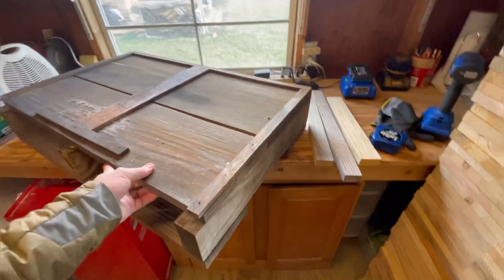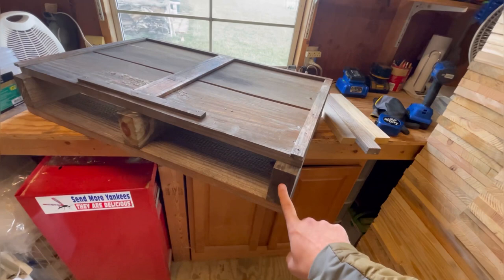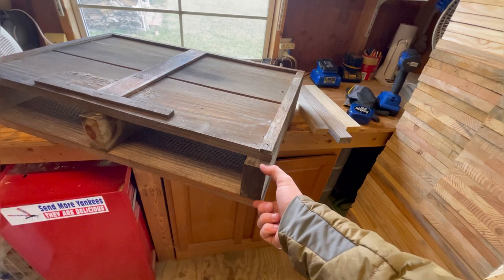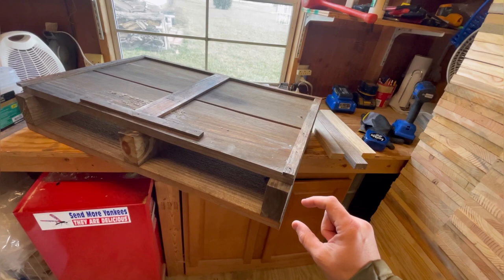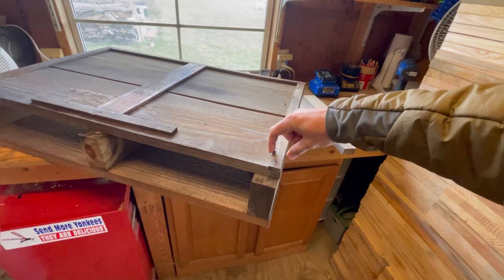Turning it around on its side, this is a true two-inch by four-inch. The two-by-fours are special milled for me. This year we're going to 1.5 by four inches. It's important to keep everything four inches so that when we stack them on a truck five singles tall, they're all the same height. Everything we deal with is in one-inch increments — this is one-inch boards, this is one-inch boards, even this piece is one inch wide run across the table saw at three-eighths of an inch.